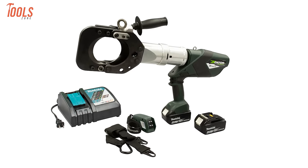You can rely on the Zeitler AG EasySpeedy Cable Feeding Tool as the ultimate solution for efficiently installing cables with diameters ranging from 0.5mm to 8mm into microtubes. Designed to connect seamlessly to a standard cordless drill, the EasySpeedy enables quick and safe cable feeding, including fiber units and fiber optic cables into micro ducts without bending. This tool is particularly well-suited for last-mile installations. When used with EasyBooster, it ensures even smoother cable blowing over extended lengths reaching up to 500 meters.